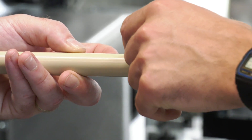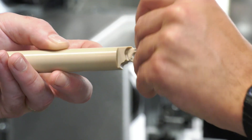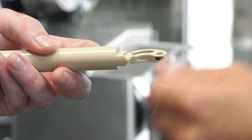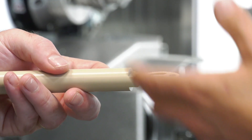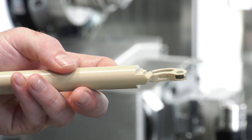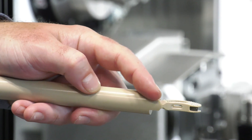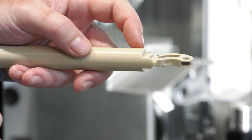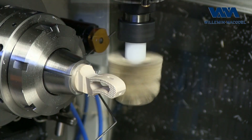It's fascinating, because normally on a milling machine you'd have to mill this side, flip it around, mill this side, and leave a little tab — then pull it off, go and stick it somewhere else, and finish it off. But with this machine you can come in and grab it; you don't have to worry about tabs. You can just mill the whole thing off and you've got a finished part. Or before grabbing, we can prepare the milling, and then with the remaining 2 millimeters, before separation, we will use the vise to grab the part and finish and deburr all the rest of the surface.